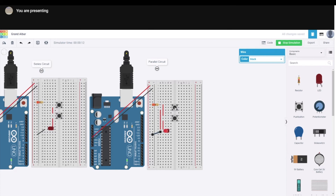When I press the first switch: positive energy goes into my resistor, into terminal one, out terminal two, down to pin 10, into the LED's anode, out the cathode, into negative. When I press the second switch: it goes positive along the 220-ohm resistor, but this time skips terminal one — it goes into this switch, out here to pin 12, then terminal one out to terminal two, and out to pin 14, down through the anode, out the cathode, into ground.